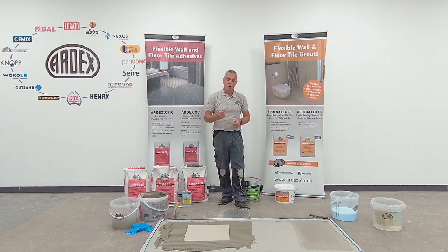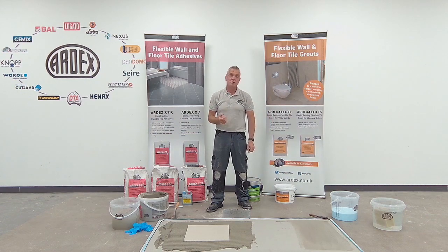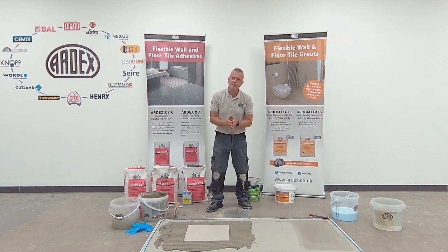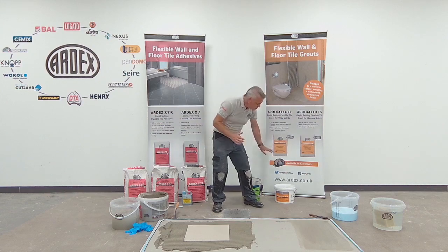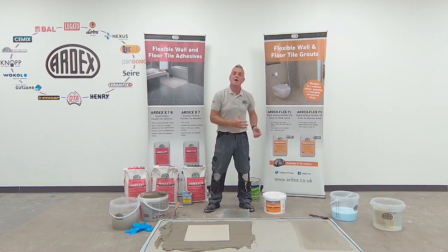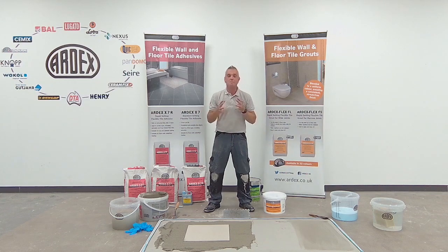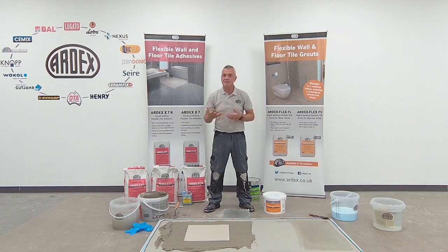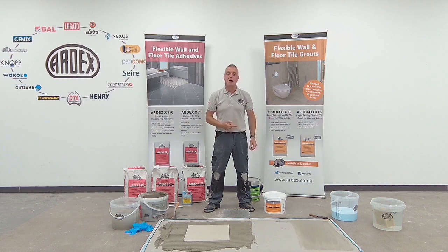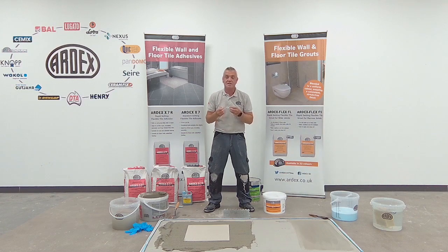These points are applicable to the adhesives we've been talking about, but equally when you're using other products such as epoxies, DPMs and epoxy grouts. Once these products are mixed up, for those who mix epoxies, you will know they heat up in the container quite quickly, certainly with epoxy primers and DPMs, but also with epoxy grouts. So when you mix up products like this, you've got here the EG18 Plus, you've got the set amounts once you've mixed up. Where possible, try to take it out of the container as quickly as possible, because any material in the container will heat up because of the mass. So if you're using things like epoxy primers, pour the container onto the floor in strips, get it out of the container so there's a minimal amount of material there, and therefore you're not causing an issue with it going off too quickly.